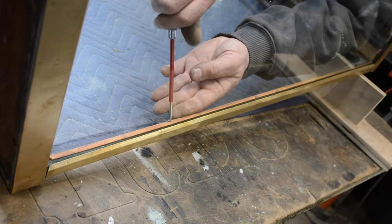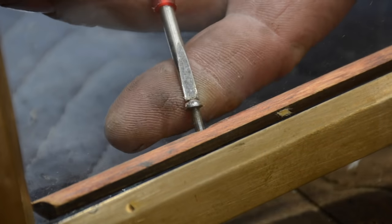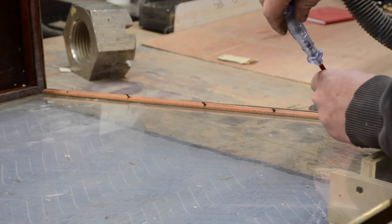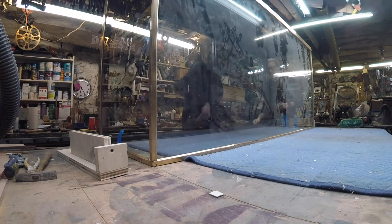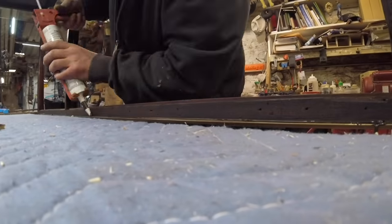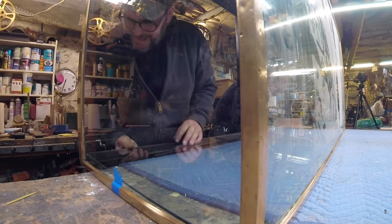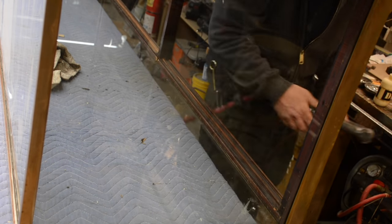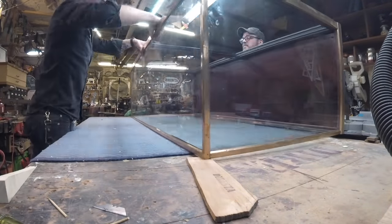These are the original corner pieces — like a little cove molding — with the original screws going right in behind the brass. The brass had wood glued into it, so the screw goes into the wood that's glued inside those brass frames, all back into the original holes. Now flipping it up for the first time and getting ready to put in what would be the top of the counter. I decided to glue the whole thing in as well as use the original strips of wood, because this is just going to have a downward pressure on it the entire time — it's always going to want to fall out. So I just wanted as much adhesion and security as possible. I'm tacking in what gets tacked in, and there's one piece for the front and two for the sides — both a little broken up, so I glued them back together and put them back in as best I could, with that bronze-colored silicone as well.